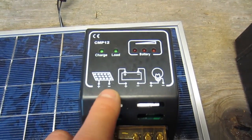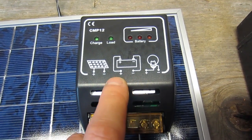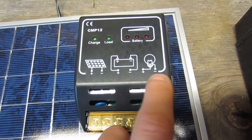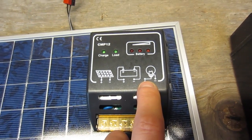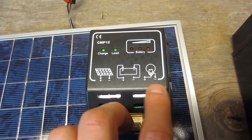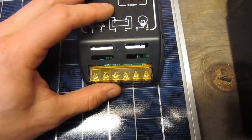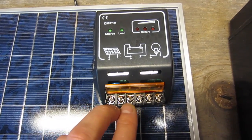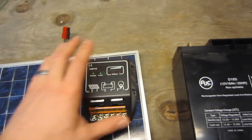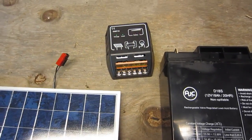You've got a picture of a solar panel — positive, negative — a picture of your battery — positive, negative — and this light bulb represents the load. Some charge controllers can shut off the load if the battery gets too low. Basically you've got four connections: your solar panel connects to your battery through this charge controller. That's the solar generator right there.